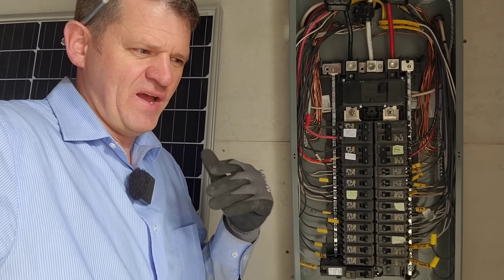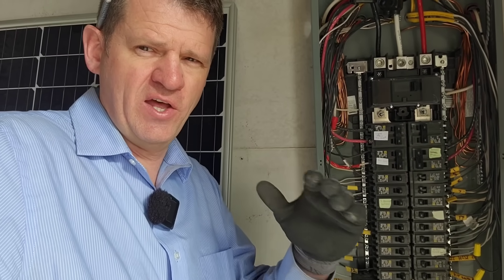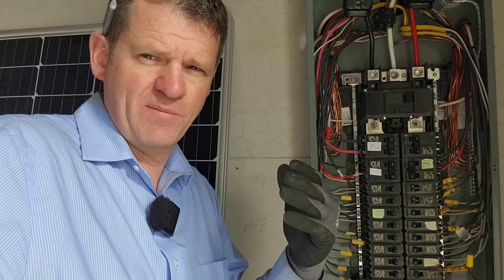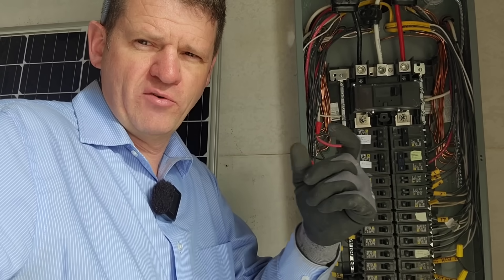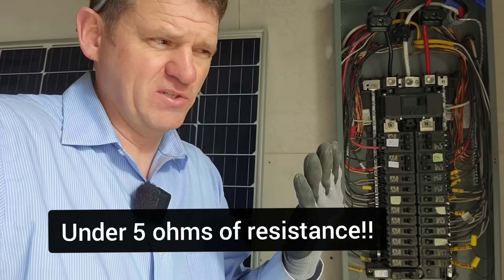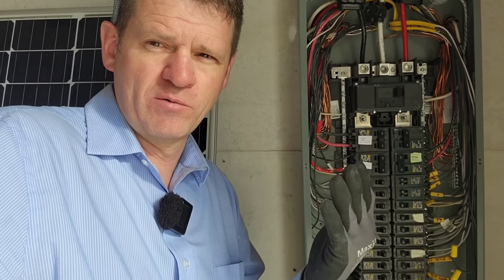The next one was way more interesting. It was actually a circuit on the outlets in my bedroom. One of the outlets had a ton of dust in there — about 40 years worth of dust and lint. It looked like the inside of a dryer vent or something. With all that dryer lint, it made a ground neutral connection that I could read with my meter. I guess sometimes too much dust builds up in those outlets — I didn't know that — and it can actually cause a fire in your house. Once I cleaned it up, that one was cleared.